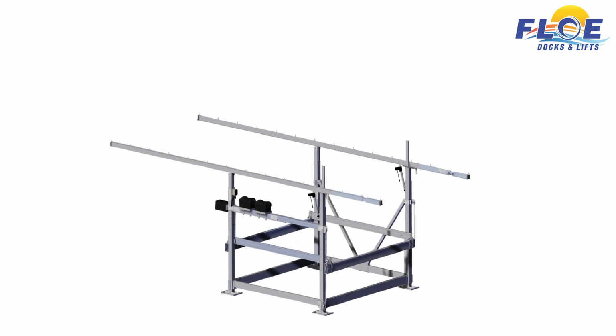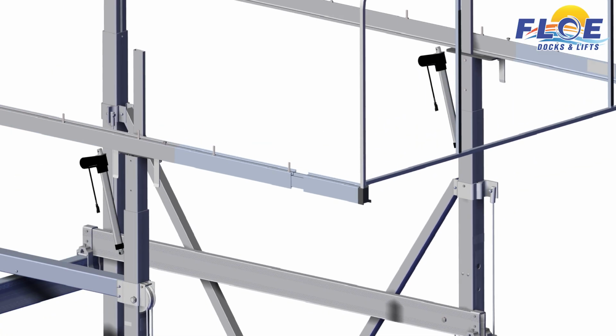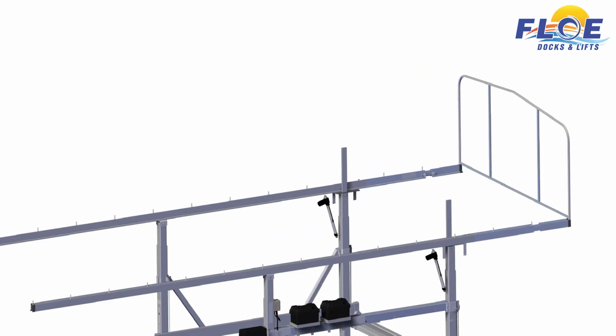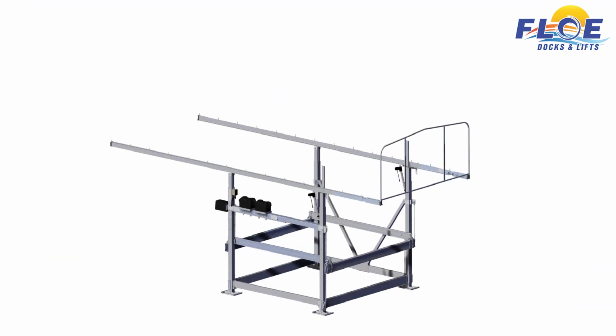Locate an end hoop and slide it onto the final set of bolt studs on the canopy rail. The end hoops are directional. Ensure that the pre-installed threaded rivet nuts are facing inward. Slide the regular hoops over the remaining bolt studs, except for the last set of studs at the other end, which will receive an end hoop.